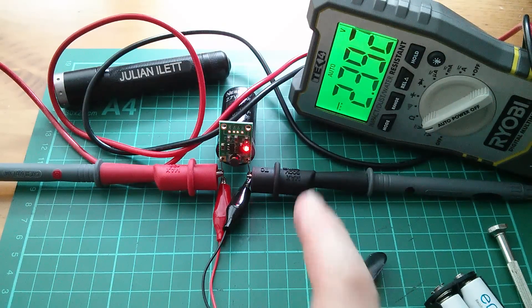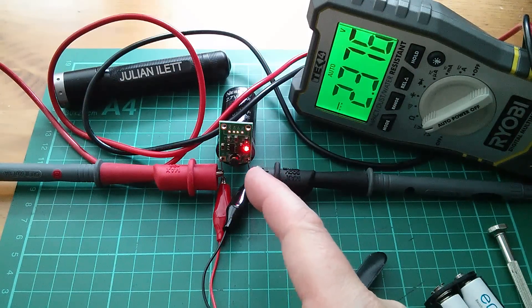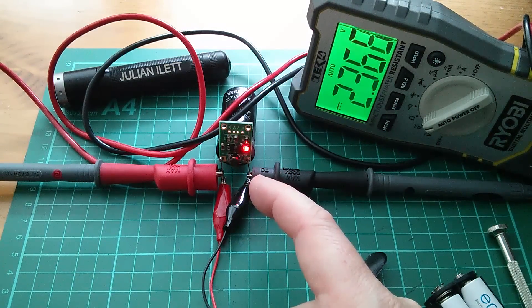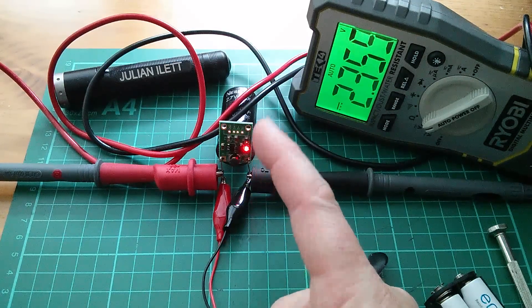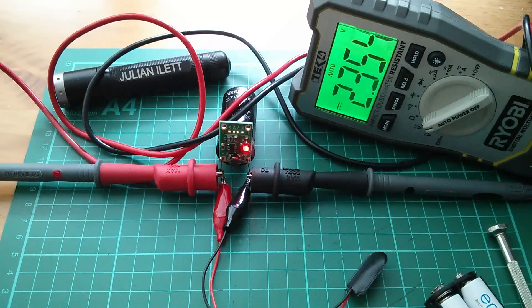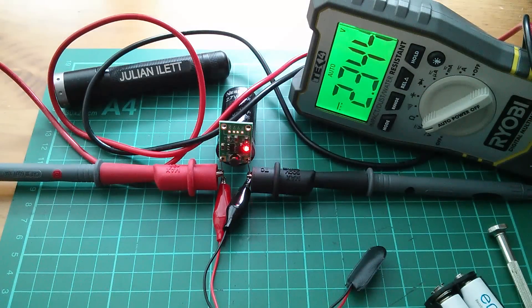I would imagine this LED will stay on for several hours — receiving a boosted voltage from the capacitor, currently 2.35 volts, boosted up to 5 volts, with the LED and a 2.2k resistor in series across that 5 volt output. Yeah, this supercapacitor has got lots of storage.